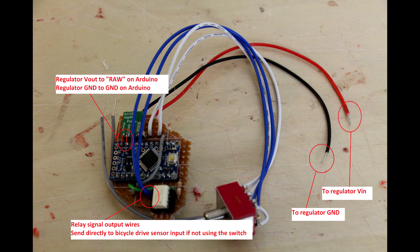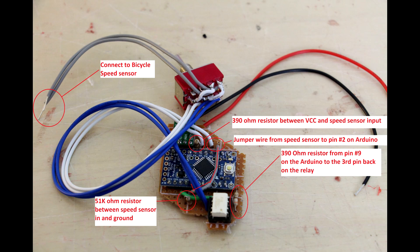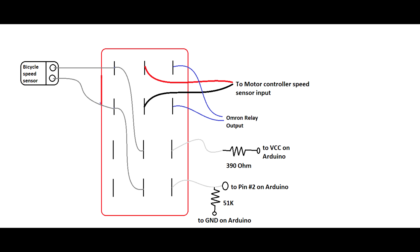Here are a few more pictures indicating how I wired everything up. The bottom board is a cheap 0.1 inch perforated board you can find on eBay or about a dozen other places. The switch in the photo is a bypass — should this microcontroller fail, I'd like to go back to the regular system. On the left is the bicycle speed sensor pin; these are the wires and leads that come from the speed sensor in the back of the bike. On the right are all the connections to the microcontroller board with the parts that connect to them so you know where they go.